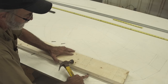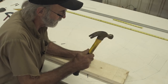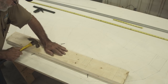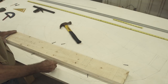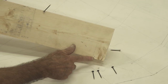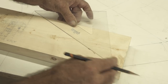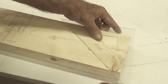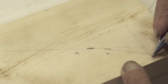I'm going to hold this nail wire down with my elbow and take a hammer and just like that. Now I can pick it up, turn it over, and you can see I've got the impression of the nail heads on the very back of this piece of wood. I've got them on the other end too. So I'm going to take a straight edge and draw a line between these points — that's exactly the same as it is on the board. Then I'll copy down my degrees and go over to the bandsaw and cut it.